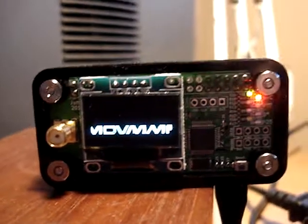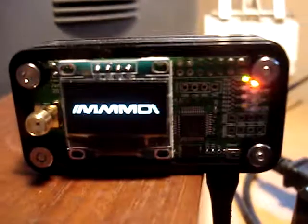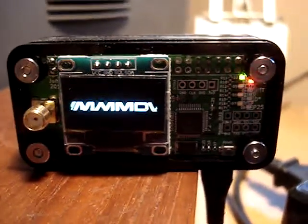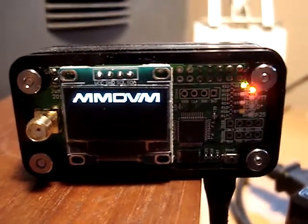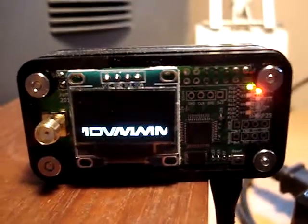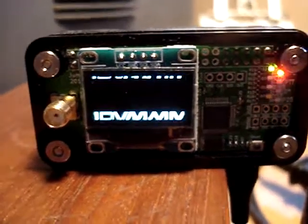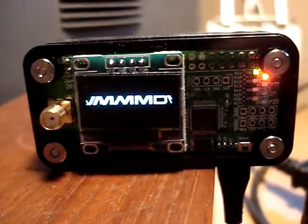When it does complete, you will see — such as you see on this little hotspot right here, which I threw a little display on, which is cool. Not very functional, but they look cool. And once it boots and connects to your Wi-Fi and pings the Brandmeister server, you will see the red light flashing exactly at this pace. You will also see the little green light steady on, just like this. And then when you push to talk on your radio, two lights will go on — the DMR and the push to talk.